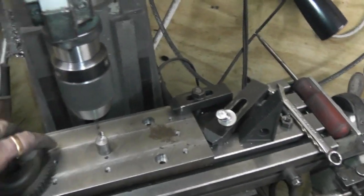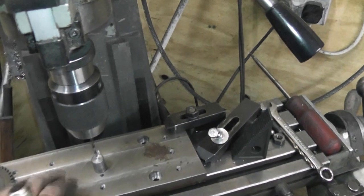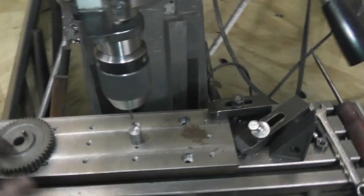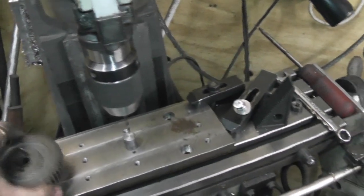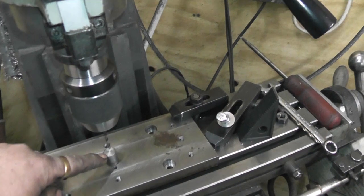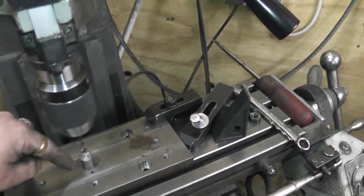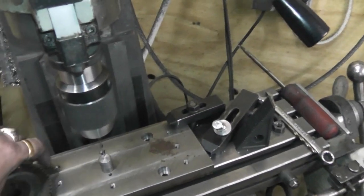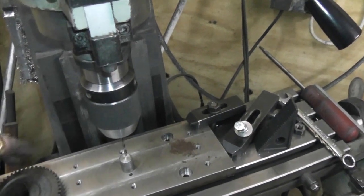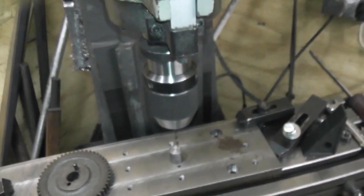Obviously it's up to you if you want to get a flatter piece of steel — this is flat, it looks rough but it is actually flat. The way I've got the spacing: that's a 5/8ths pin by the way, it's 5/8ths and it's threaded M8, so it threads onto these holes that are already here, and this makeshift pallet that I did for a horizontal bandsaw.